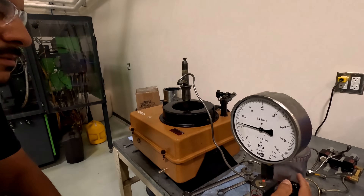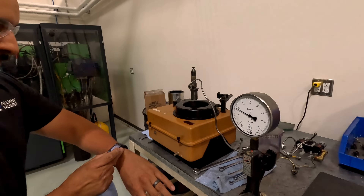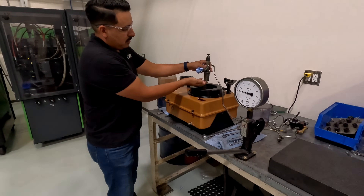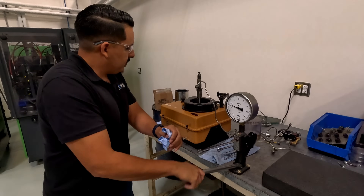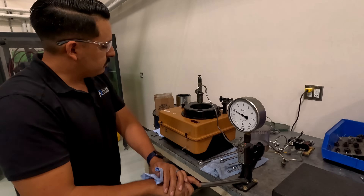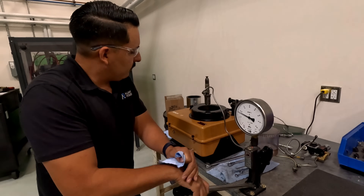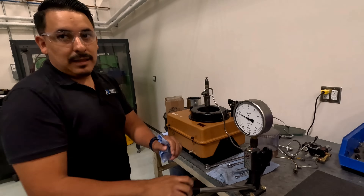They're kind of just squirting a stream — there's not much atomization. If we go to check the opening pressure, it's just shy of 100 bar, which is going to be 1400 to 1450 PSI. That's dry — that's allowable, so that passed. It passed the leak test. My rule of thumb is typically they're gonna be working like this in the engine, and what I did was just a low stroke. You expect that on these indirect injectors — the old school guys said this is pretty allowable.